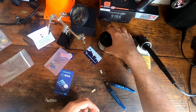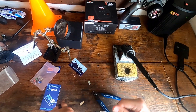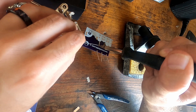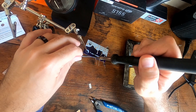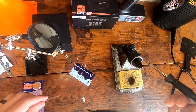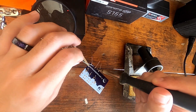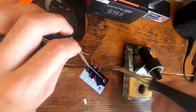Let's put it back here. Now you just get your solder — I'm gonna rip a little piece off because I don't need a lot. Then we're just gonna put a little bit of solder on the tip, put the tip to the edge, then just put the solder in and pull away quickly. Same thing on this side: tap it, solder in, pull away quickly. Finish these off the same way — get it a little hot, solder down in, let it flow, and then pull away.